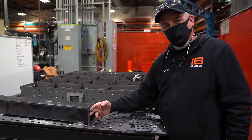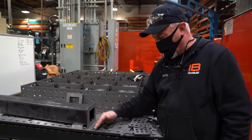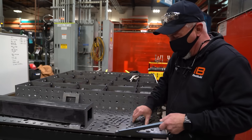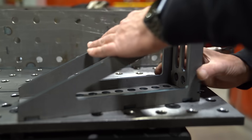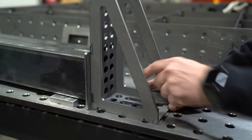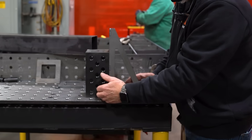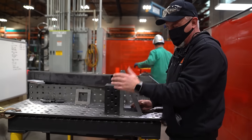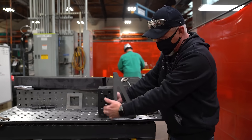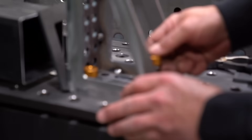We're getting ready to put our leg mount onto the top of the leg. One of the things we want to make sure is that this leg mount is perpendicular to this surface — we made our own set of fixtures to do that. If you come around here, line the holes up and drop our pins in there — that'll give us a vertical surface by which to reference and get a good weld on this. This block is a precision machine block that we already know is true and square to this table, so we're gonna use it just like we used our master to build this table. I'm gonna use this master to square up my fixture so I know that my fixture is as square as this is.